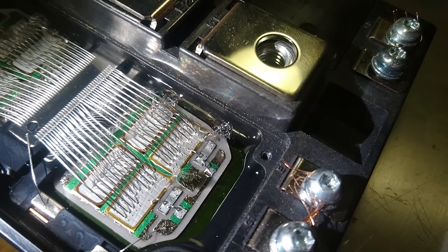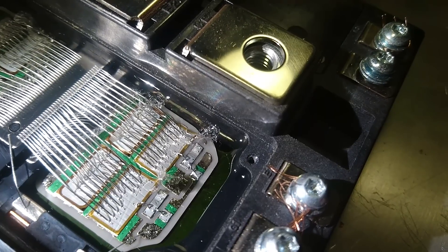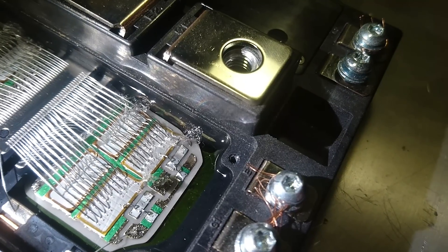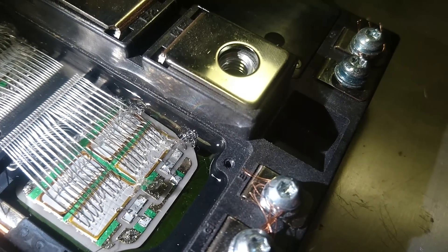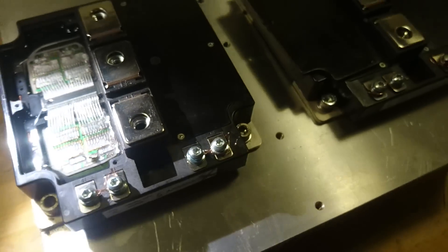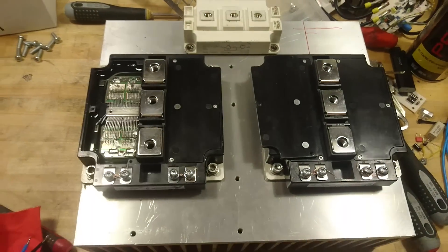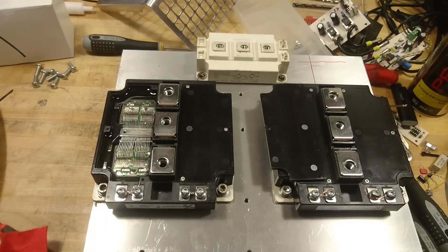So with the last of the 32 bond wires wiggled out, as you can see the traces left in the goop become neater and neater. The trick is to lift it up very slowly and try not to introduce too much gap or air into the goop itself. So now my CM600 full bridge is hopefully back in a condition where I can drive my large Tesla coil without getting limited above 1200 amps of primary current.